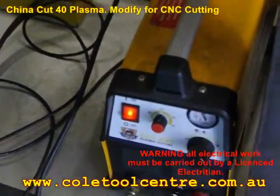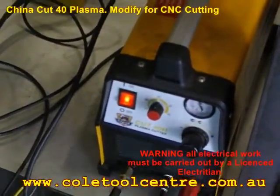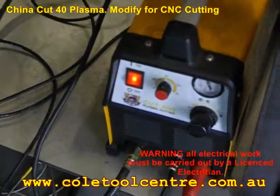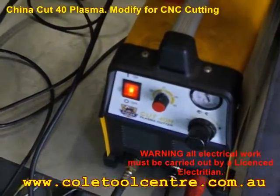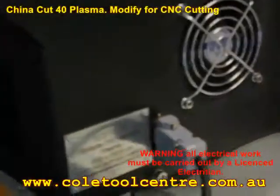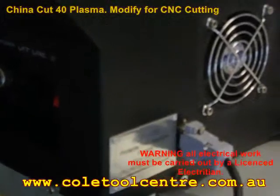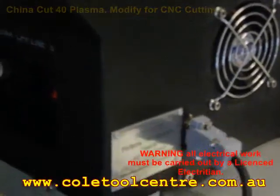So the conclusion of the exercise is that a non-CNC type plasma cutter, which has only 1-to-1 voltage coming out of it, can be used to drive the torch height control. The divider board has to be placed inside the plasma cutter and wired up internally, so that the plasma cutter sends the voltage to the 9-pin plug on the CNC machine. We bypass the CNC machine's own divider and go straight to that 9-pin plug. So basically any plasma cutter should be able to get going with a divider board.